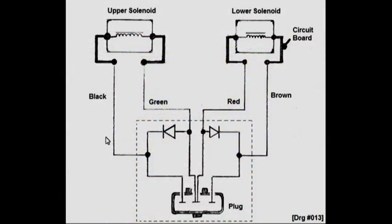Hopefully you'll never have to do that. This is a diagram representing the solenoid wiring. The colours I've shown — black, green, red and brown — are the colours that were on the exhaust solenoid wiring. The colours were different on the inlet solenoid wiring but the routing of the wires is assumed to be the same. I can't see why it would be any different.